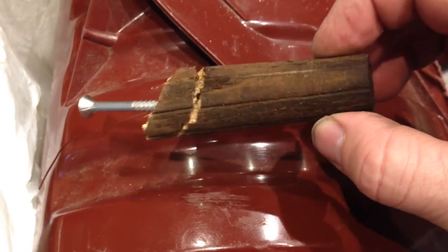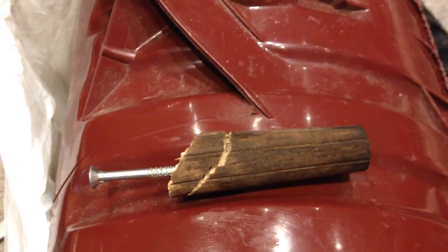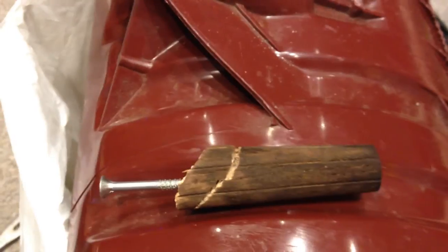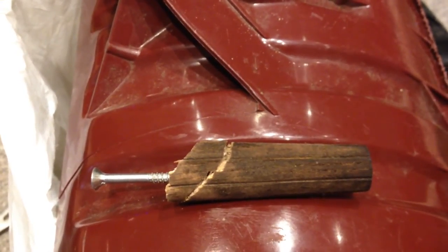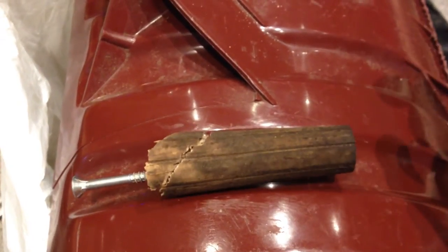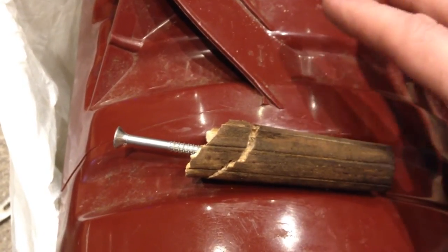The question arises: why does the manufacturer design the handle end to taper? Why can't the handle just go in at its full diameter? The reason for the taper is that when it breaks, you're forced to go buy a new tool — that's why they put a taper on it. Otherwise you'd have to hand-cut it unless you have a lathe. I'm going to show you how to reproduce this taper with simple hand tools — no lathe or power tools needed.